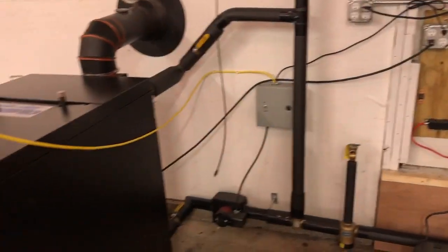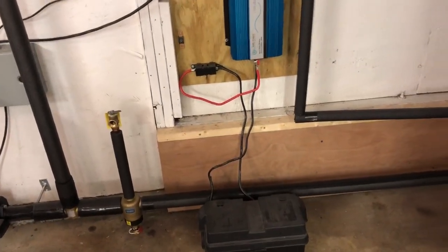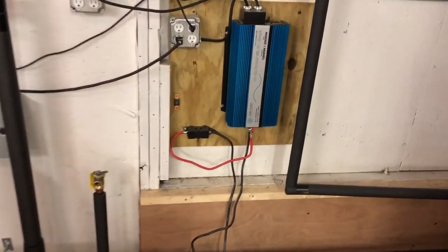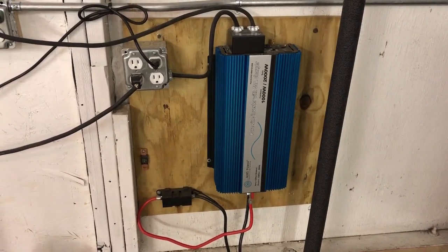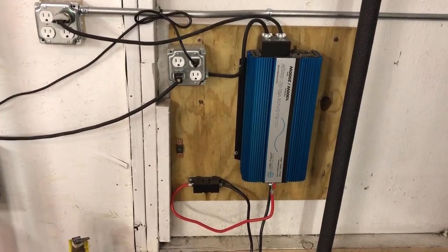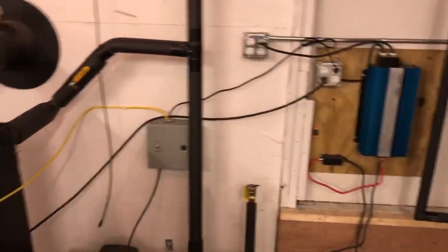That circulator pump is keeping your boiler temperature under control. To address that, I've installed a battery backup system: a 12 volt marine deep cycle battery and a pure sine inverter rated at 1000 watts continuous. This inverter has a built-in transfer switch that, when it detects a power loss from the power company, within milliseconds it automatically switches to the battery. The boiler and whatever else is powered by it doesn't even really know it suffered a power loss — things keep running correctly.